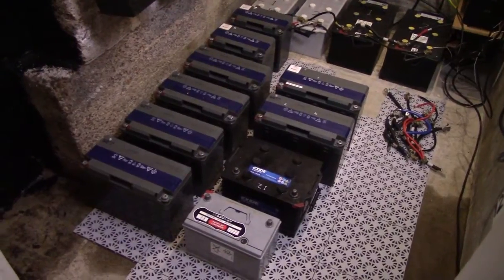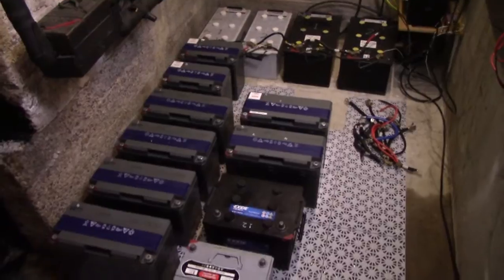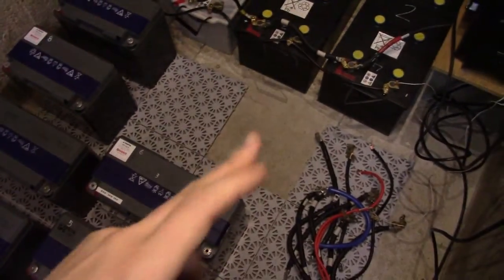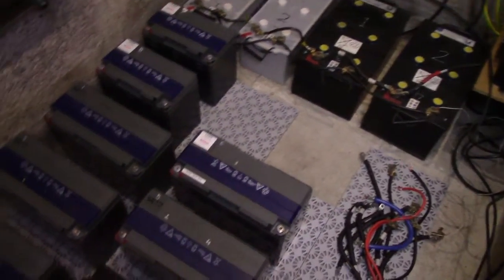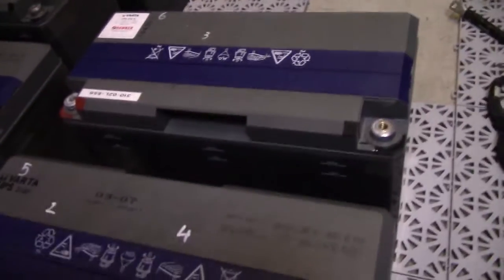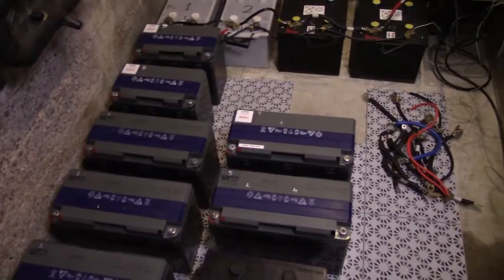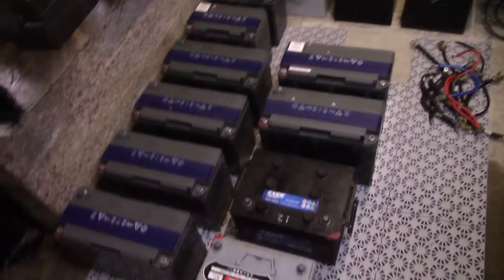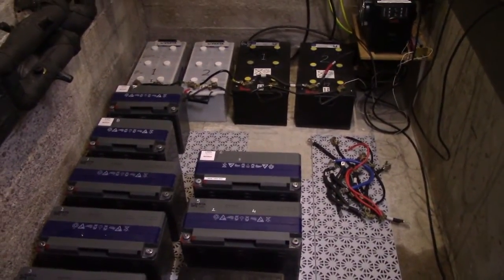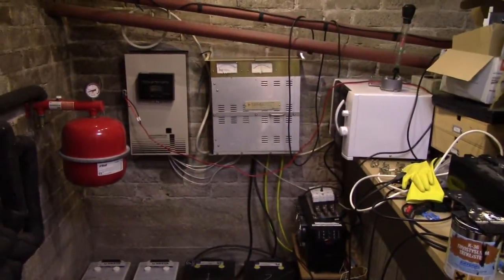Time to get at it—this is going to be a rather major procedure. And there we have our initial setup for the new batteries. I've tiled the floor, most of it anyway. I don't want to buy more of these tiles than I have to. I've spaced the batteries rather generously using a suitable tool, just so that I can easily get in and feel around and inspect the electrolyte levels and so forth. It's important to just keep an eye on everything since I'm running a massively parallel system that is not fused as it should be.